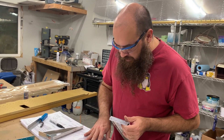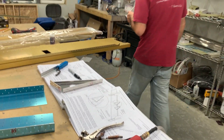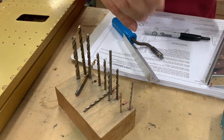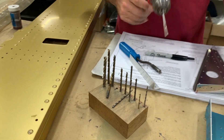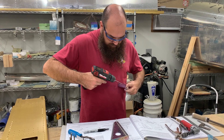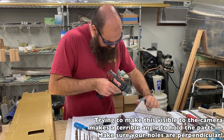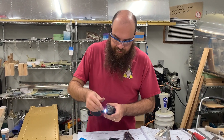So they want me to first drill number 19 for the screw holes and then number 40 for the other holes. Let's get all of these drill bits out here. I made this little drill bit block, which has seen cleaner days, and I've numbered the holes. So I just grabbed the number 40 reamer and I'm going to ream these. That's all the number 40s.